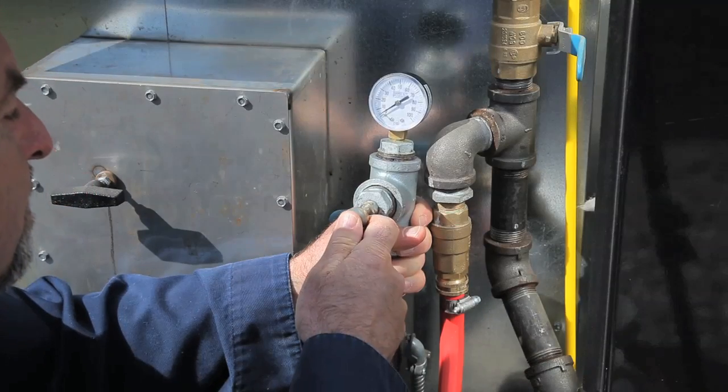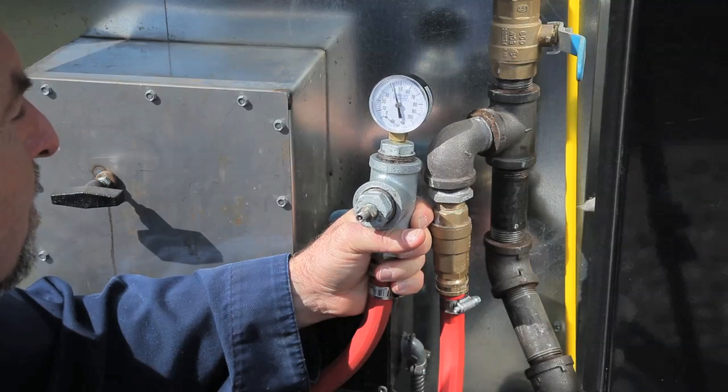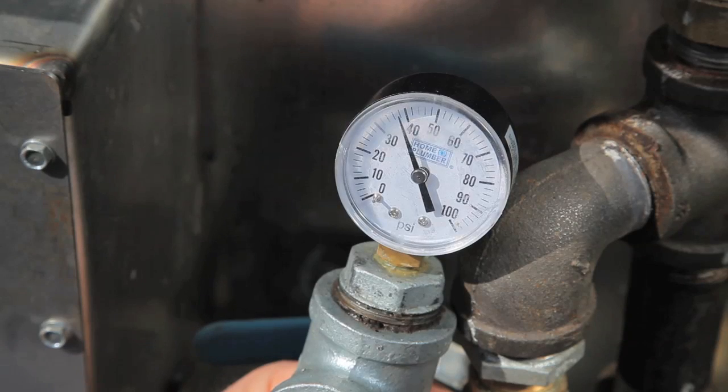Regardless of how you make your pipe connections, I strongly recommend that you pressure test everything with air before you add water to the system. It's just a whole lot easier to make repairs if there are any leaks beforehand. Now here you can see the gauges and fittings that I put together to allow me to pump compressed air into the pipes and then watch the gauge pressure. The slightest leak will cause that gauge to go down, so it's easy to spot if there are any problems.